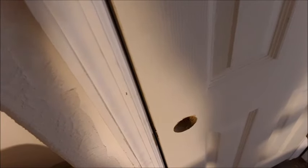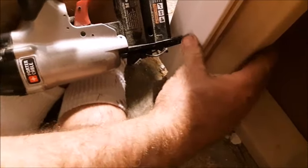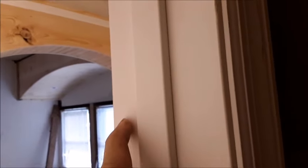Now it's time to start putting shims in the side so I can get the doorknob side of my enclosure exactly right. I've made up a spacer block — you can use multiple layers of different plywoods or panels. I've stuck the block in firmly against the 2x4, pulled it in this direction, and put a brad through it. Once you get your bottom spacer in place, don't assume all the spacers will be the same thickness — your 2x4 may not be perfectly straight, so you may need micro-adjusting in the middle to avoid bowing the door frame, which could cause the door to hit in the middle when closing. Now it's time to put the back side of our pre-hung door together — it slides right into the groove and we push it tight to the back side of our 2x4 framing, then nail the center to perfect the squeeze between the two pieces.